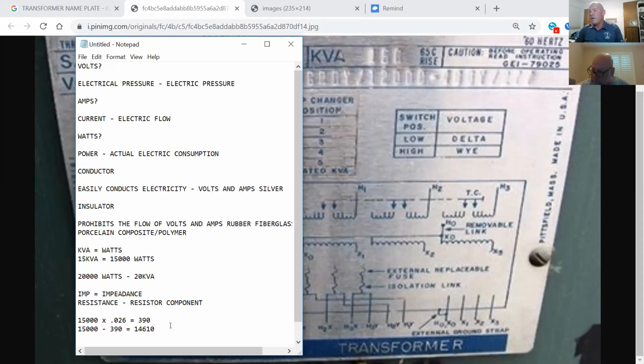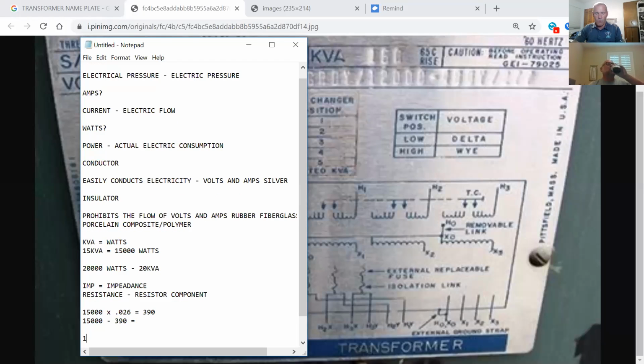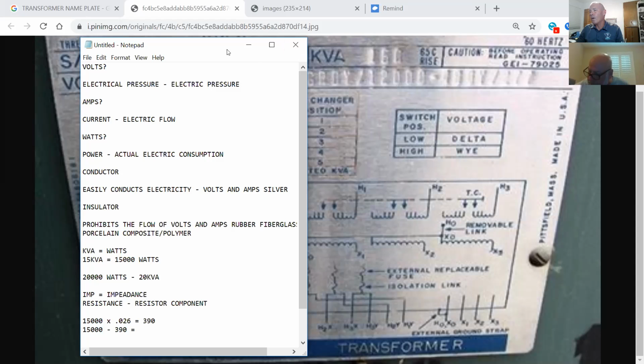1,875. That was your first calculation? Yeah. Okay, so that's what you need to subtract from 150,000, depending on your math method. 148,125. So if I was asking for the final answer, what's the true kVA of the transformer? The answer was 148,125. If I tell you to convert that to kVA, you're going to do what? Move over 3 decimal places, 148.125 kVA.